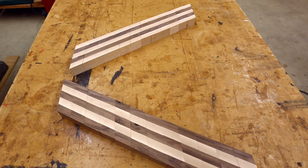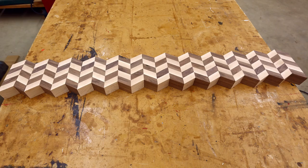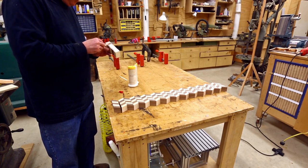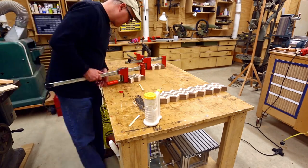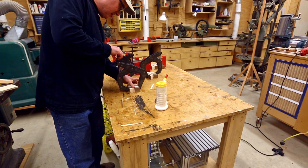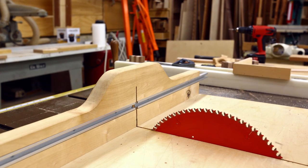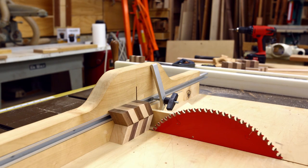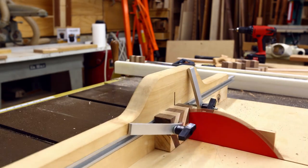You can see how the two strips get married together to make the pattern. Then I'll glue these up in pairs — not making a long piece again, just two pieces glued together to make pairs. Each one of those pairs gets processed into a segment for a ring on the bowl. I'll slice off the angled ends at the table saw again, setting up a stop and a little clamp to hold the piece in place so I don't get my fingers too close to the blade.